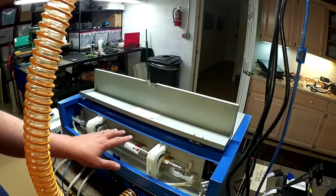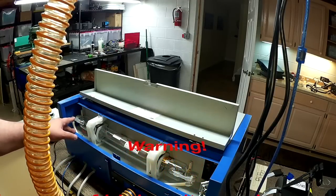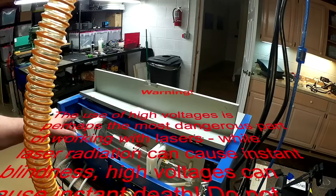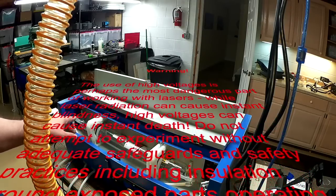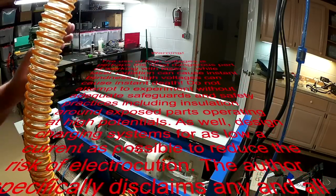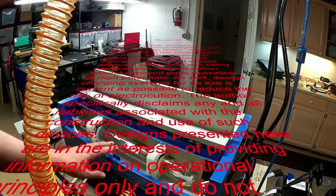I want to start out talking a little bit about the laser tube, but first I want to talk about safety. This is a high voltage device. On this end of the tube, it was 15 to 20,000 volts when energized. While it's low current, it is enough current to arrest your heart, and obviously if your heart is arrested, you die. This has to be performed with a lot of caution. I'm not showing you how to do this in this video — I'm simply talking about how I did it. If you decide to do it, you're doing it on your own, and you need to take proper safety precautions.